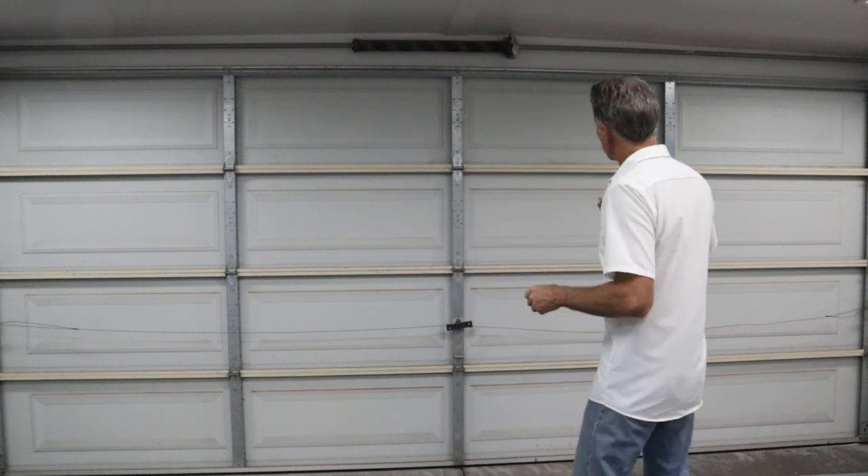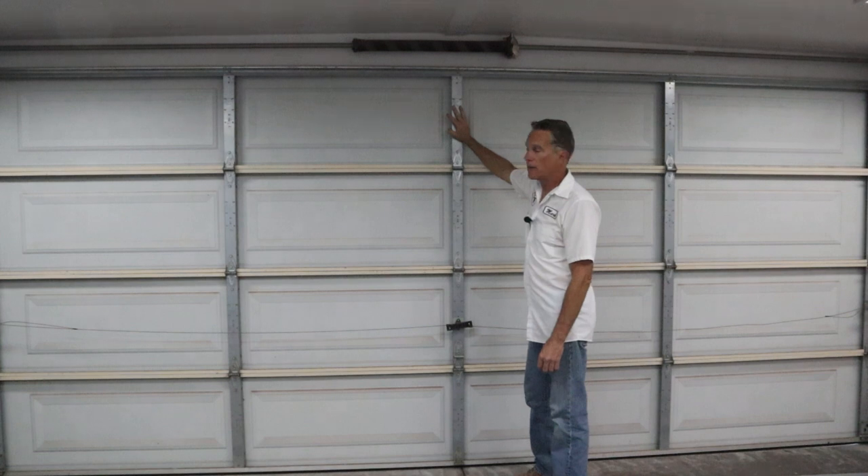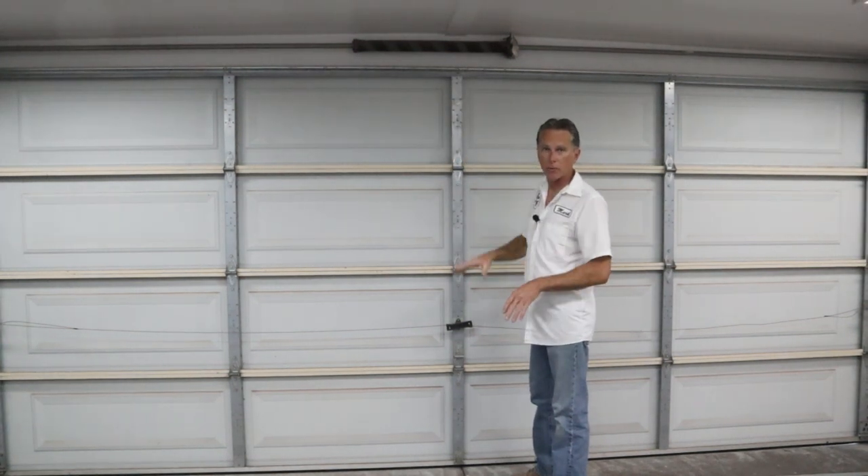My number one enemy is bugs, just like yours. What I do is take the top panel off of this roll-up door, set it aside, and replace it with a frame I built out of steel studs — like 2x4 steel studs — and some galvanized angle iron or angle sheet metal I found at Lowe's. I just kind of pictured it in my head, bought a few pieces of everything, spot welded it together with the MIG welder, and screwed it together with sheet metal screws. That upper piece basically has holes in it and holds spray booth filters. You could also use air conditioning filters — you just need something to stop the bugs and dust.